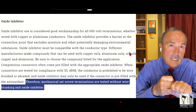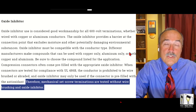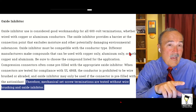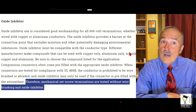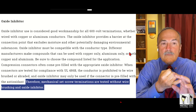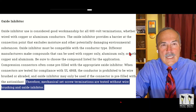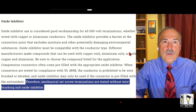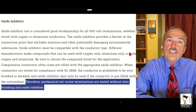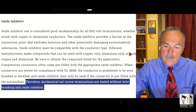None of them need to be filled at all, but interesting — when you have the set-screw mechanical fittings and they go to test by the listing laboratories like UL, they don't have any antioxidant when they're doing the testing. So now I'm wondering: if they tested the wire and fittings without antioxidant, maybe it's not a good idea to add it, because now it was never tested that way with aluminum alloyed wire. Also, there is a listed antioxidant for copper and a listed antioxidant for aluminum — I wonder if there's a chance somebody might switch the two containers and not realize this one is for copper, not aluminum. So I don't even think it's a good idea to do any of that. However, there are industries and locations with a huge amount of corrosion — on the beach for example — where it might help, but that's not code.